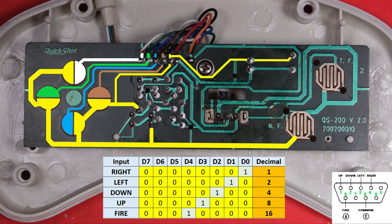Things are going to get a bit more involved now with fire. Fire is our orange cable, and it comes through here over towards the right, via our slidey switch. Starting with the slidey switch on the left-hand side - which corresponds to not having auto fire active - we trace it through to the fire and turbo fire button pads. When we press fire, it's exactly the same as with the D-pad: it shorts these two contacts and our fire wire is shorted to common.